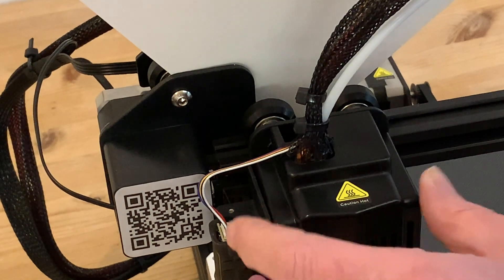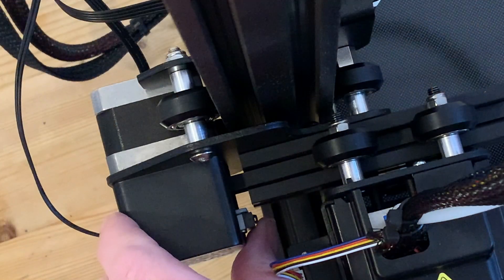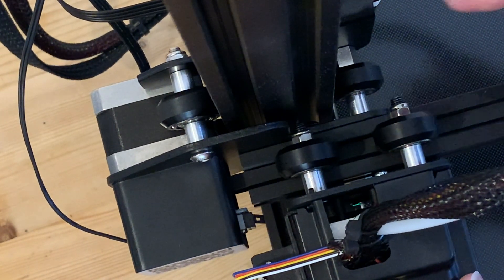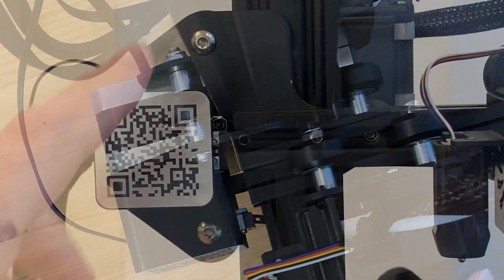The drive belt is still trying to move it and that's the cause of the awful noise. We can see this really clearly from above — there's our switch, and here comes the printhead, and it's the end of that roller axle that's hitting the plate.